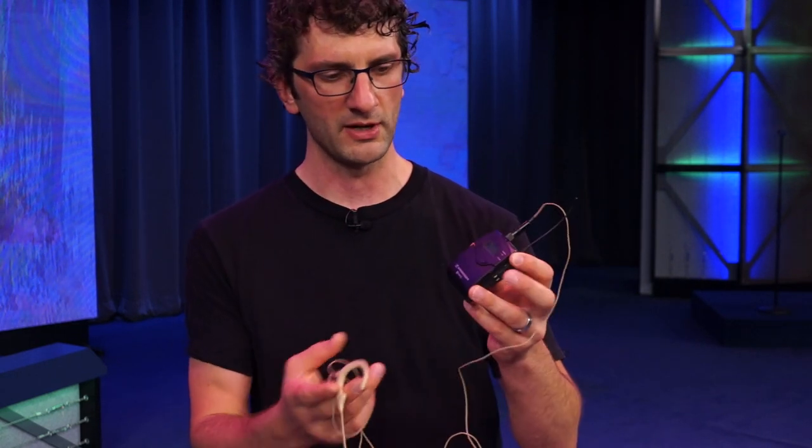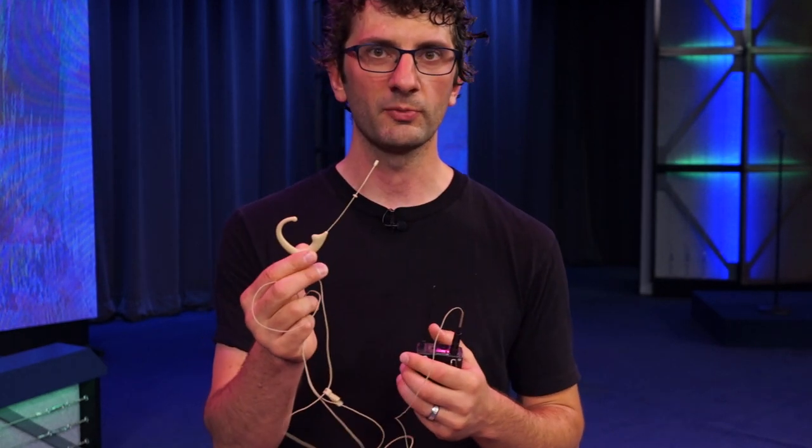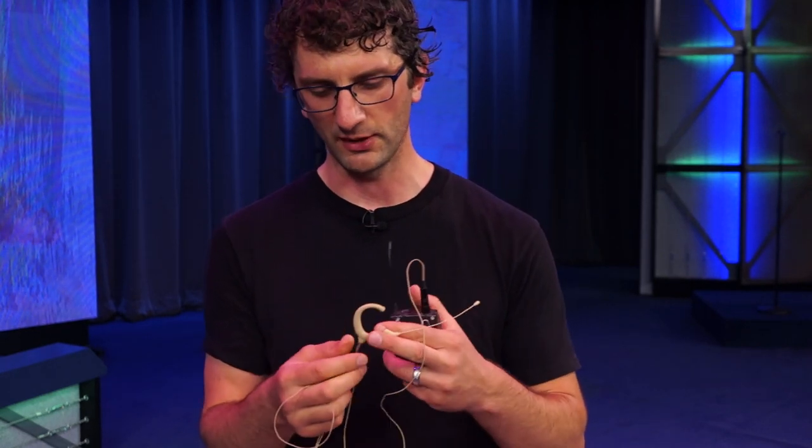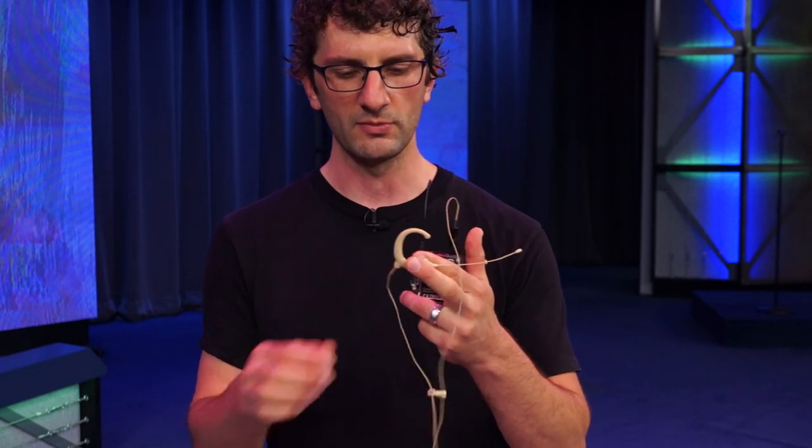There are a few different versions of the Sennheiser packs, but this is the main one — it pinches open and turns on. The biggest problem people are having is sometimes these cables will go bad and crackle, and people don't understand what exactly is happening. People have asked me for replacement microphones, but the microphones themselves very rarely die. It's almost 99% of the time — if your mic is not working or you're crackling — it's going to be this cable.